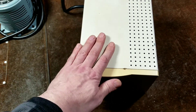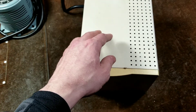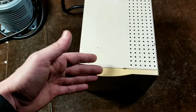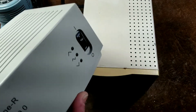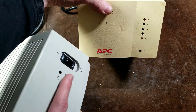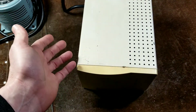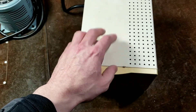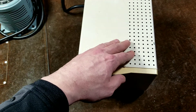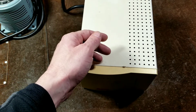How these work is they have a filtering section like a high quality power strip, and then a big transformer inside. This is rated for 600 watts continuous and is fuse protected. It primarily comes in 600 watt, 1200 watt, and 1800 watt versions. The unit has an auto transformer with a variety of different taps, and circuitry with relays that when input voltage drops too much, flip and switch to another tap to provide a boost.